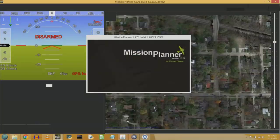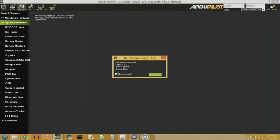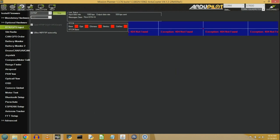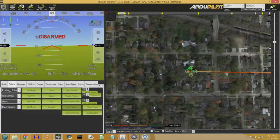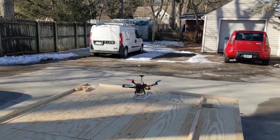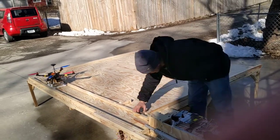Here's what that looks like on the laptop. AutoIt opens up Mission Planner, moves the mouse to click connect on the drone, and turns on base station corrections. This is important — it increases GPS accuracy from a few meters to a few centimeters, which really helps us hit the center of the landing pad. Then it goes to the flight plan, loads it up, and sends the drone into the air. The last two stops of every mission send the drone toward the battery swap station so it lands in a known orientation facing it — no need to rotate the drone after it lands.